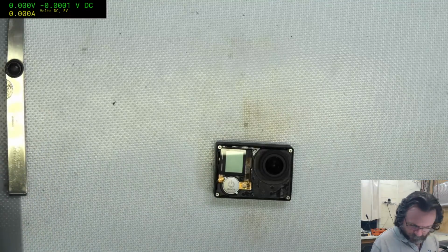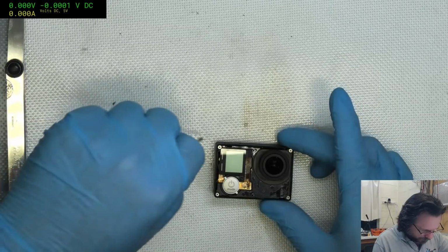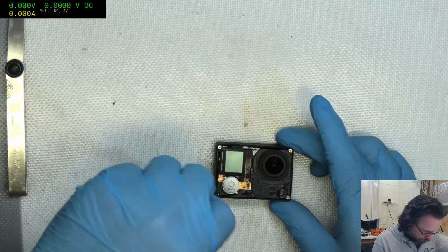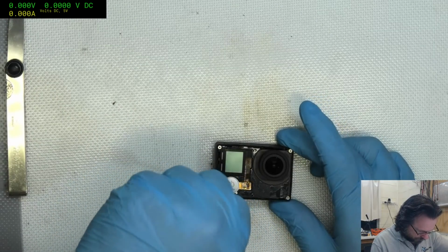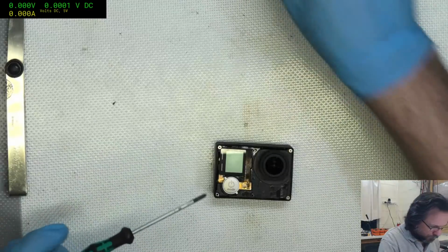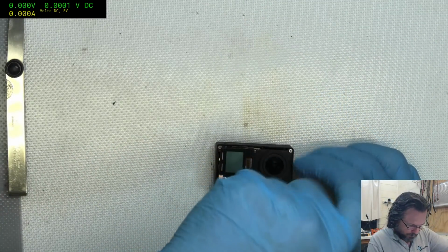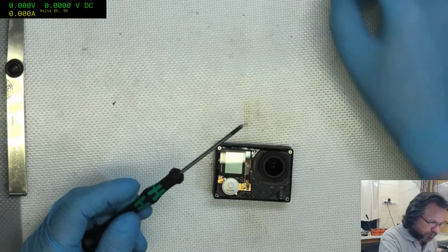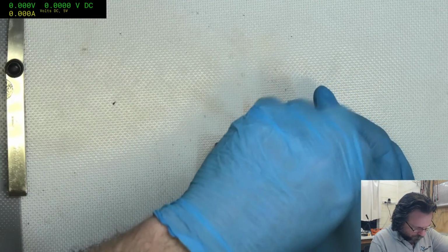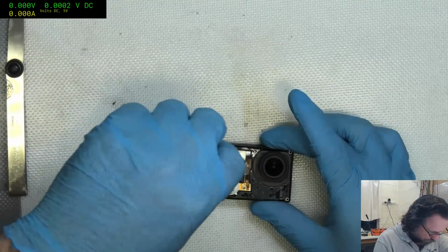By the way, that Lenovo machine from earlier today, the hard drive on it was also quite problematic. While it didn't have a tremendous number of bad sectors on it, it was very quickly heading that way. I was getting only about 10 or 20 megabytes a second on average for the transfer.